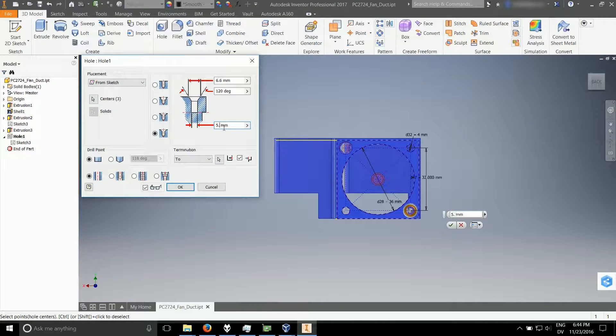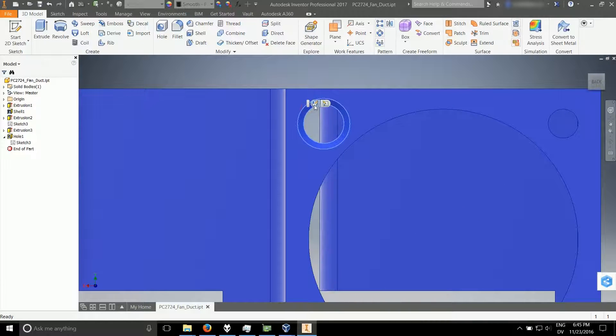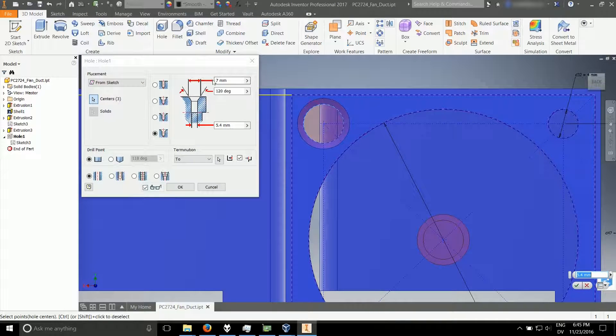I think the mistake we made last time was I meant to say you add 0.2 on each edge. A hole, being a hole, basically has an infinite number of edges, but throughout every point you'll see two edges on every side. The chamfer will have to be edited — I think 7 millimeters might do. We're going to print a bunch of prototype tests to make sure it actually works. Even when I was doing the actual print, it had to be a bit wider than 7, so let's try 8.